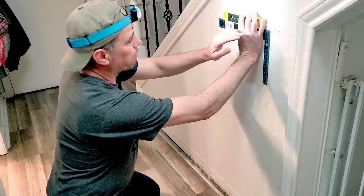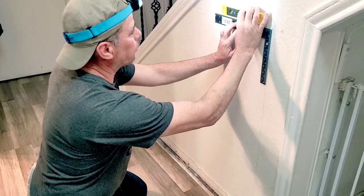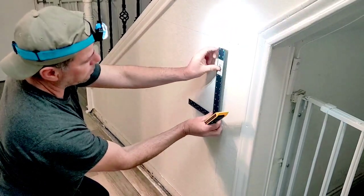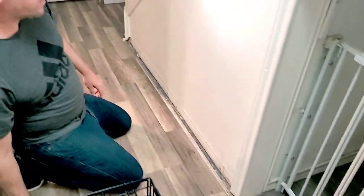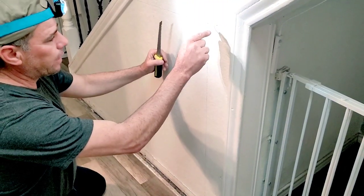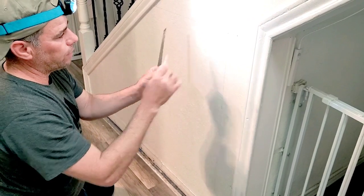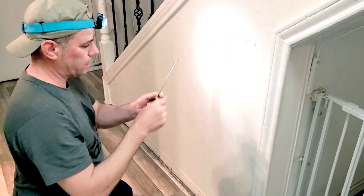The way I marked this line — I marked it with pencil right here. I put the ruler, level it, and then mark it. You can have a longer ruler; it's a lot easier to mark all the way down. I put the level here and mark it. When I poked with the little wire, I found out the 2x4 is right here but not here, so it's good because you can just seal it later in case you make a mistake.